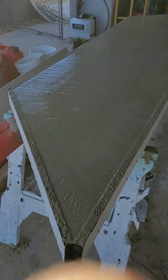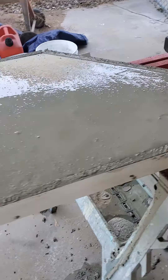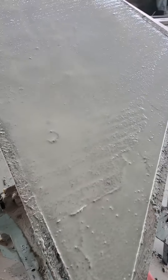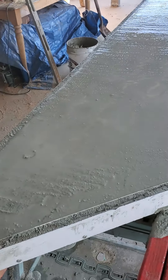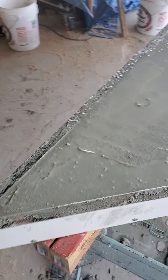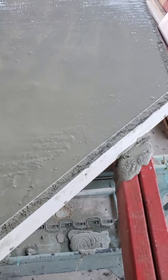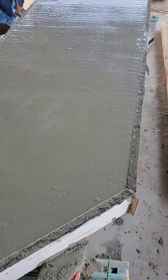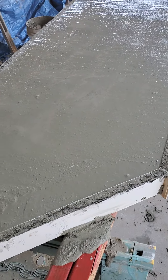Okay, we're back. We've just screeded out the concrete in the form. We spread it down with a little bit of water just because we're starting to dry out. We used a Sawzall — we're going to use this Ryobi Sawzall with no attachment in there just to vibrate the edges to get all the bubbles, voids, and air traps out.